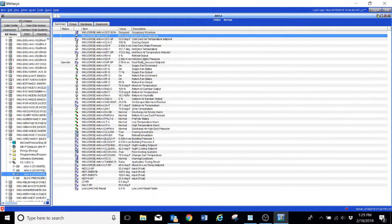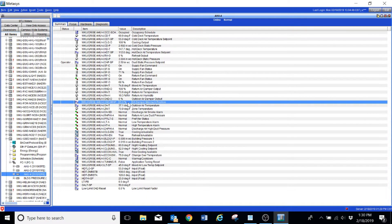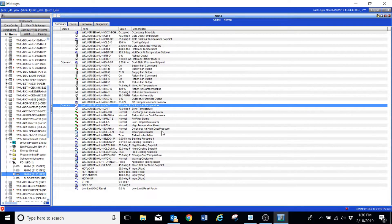We're currently at 37 degrees outside, our minimum set point for the outside air damper is at 35 percent, and it is completely ignoring it. But if I tell the system that our outside air temperature is actually warmer — I've overridden it to 50 degrees just to make the air handler think it's warmer outside — notice how the system reacts. It'll take just a moment to swing, but you can see right there the outside air dampers have now gone to 100 percent. This is a little unusual control, wouldn't you say?